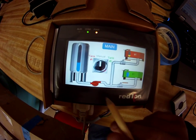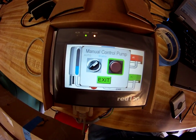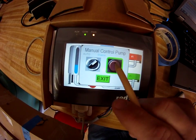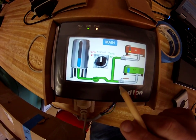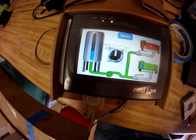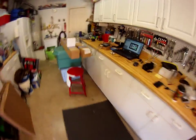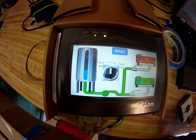It says manual mode has been chosen — check the valve positions. That's a caution notice there. If I want to run in manual mode I click right here, authorize it, and commit it. The pump turns on. Notice the pump is filling — I don't know which valve it's going to because it's not being controlled by the program, but the pump is on as you can see out in the field, and I'm filling up whatever tank they happen to have the internal valves set to.